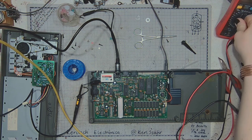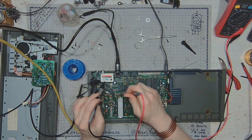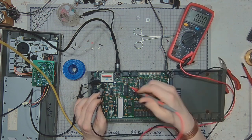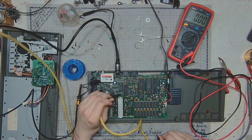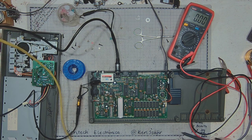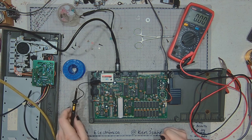That's pretty interesting, that LK7. I probably shouldn't have touched it, because I got 1.6 volt DC in the P position, the Peritel, and I've got the audio signal on the S position like it was originally. Come on, that's bullshit. It's completely different than in the schematic. You can never trust the schematics for those things.